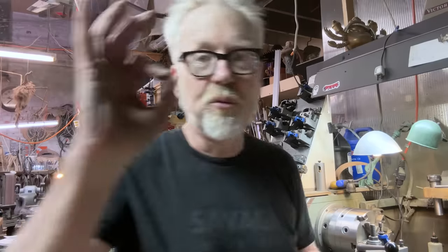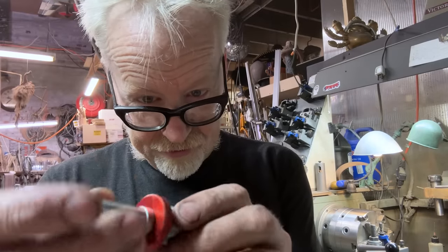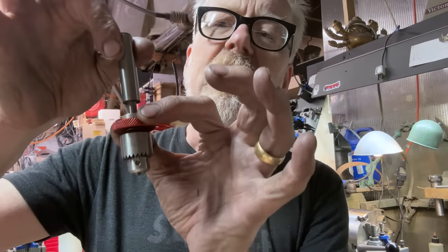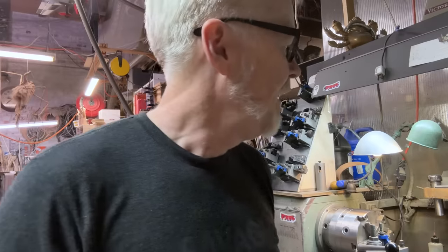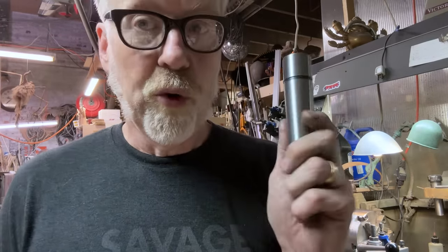When you want to do sensitive drilling on the mill, you use something like this, a Jacob's Zero Chuck. This is a JT Zero. Actually, I think this is a knockoff JT Zero. Oh, it is. So this chucks into your mill and you do this business. Now, the fact that it's rigid helps, so maybe what I'm considering is getting a second one of these Morse taper MT4 blanks, because this one's spent, and putting this in it to do my sensitive drilling.